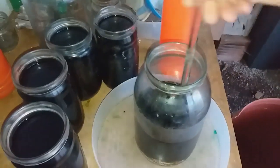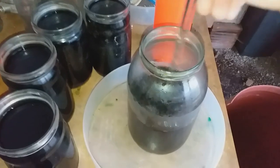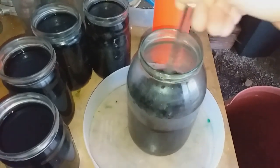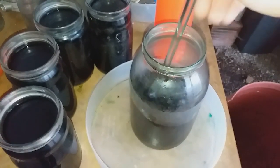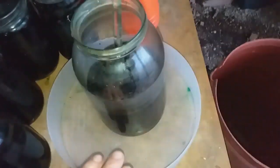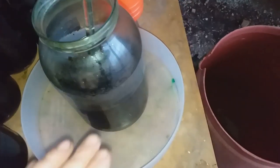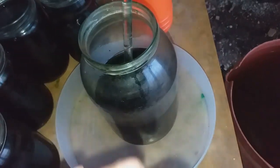When I add new acid and leave some amount of the old acid, all those copper ions from the old solution will speed up the process, and the new acid will automatically start to dissolve the pins. Still black — but that's very good. When it's black that means the solution contains a lot of copper ions.